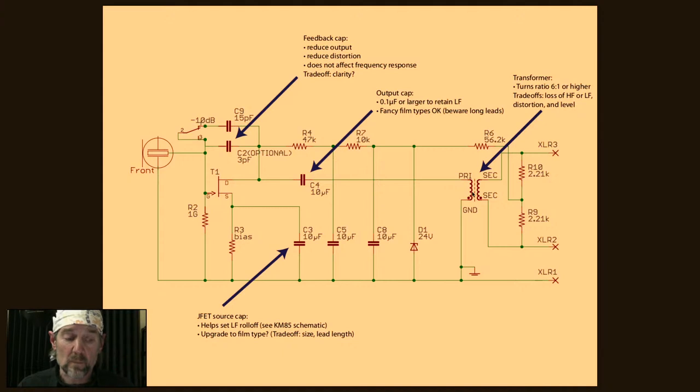And as a mic designer, what your job would be is to figure out if that roll-off complements the sound you're going for, the capsule you're using, the capacitors you're using, and the kind of mic that you want to build. So if you have a really bright capsule, maybe you want a transformer that's rolled off on the top, or vice versa. If you have a capsule that's kind of thin, then you certainly don't want to have additional low-frequency filtering coming out of your transformer.